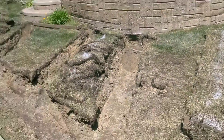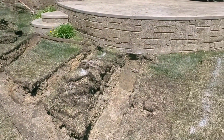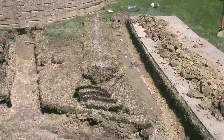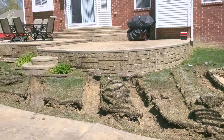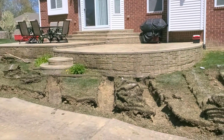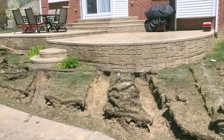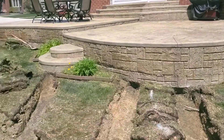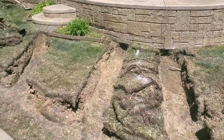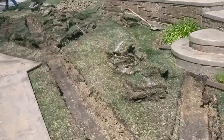Here's the low part of the yard right here — look at the elevation of the ground. This is where the water problem is. It sponges up all that water during a rain event, then it just oozes water for not days but weeks. By the time the yard dries up, this thing is still releasing water from the base material, and then eventually we get rain again. The homeowner really never sees the ground dry near these elevated patios.